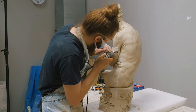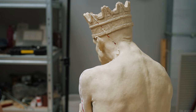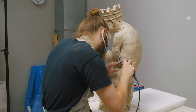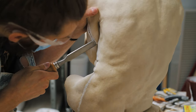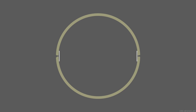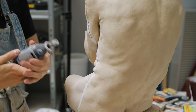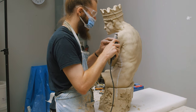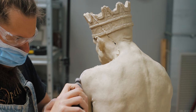We have open seams, which is where material didn't make it to the seam between the two halves of our mold — they are open holes in your piece. Obviously sanding is not going to do anything for us here, except make the hole bigger. If I can reach the place where the open seam is from the inside of my casting, I will cover the opening with fiberglass from the inside and then re-sculpt the surface from the outside with resin. If I can't reach it from the inside, I will simply have to attempt to re-sculpt it from the outside, which can be very tricky since the material wants to fall into the open hole. Filling these little by little with thick resin tends to work just fine, though it is a bit of a finicky operation.